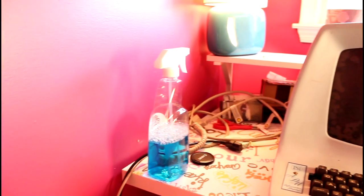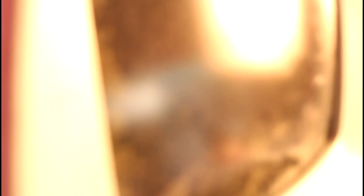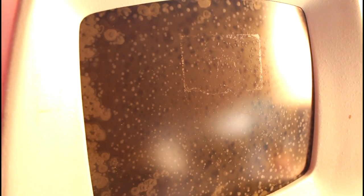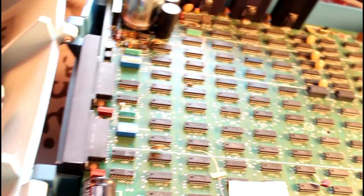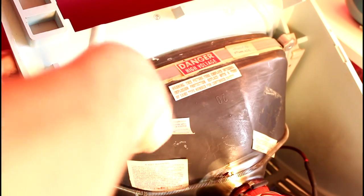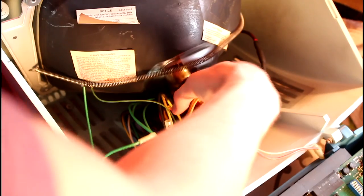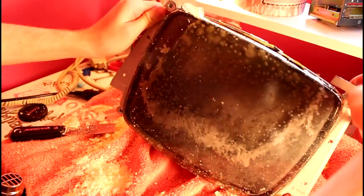But while I'm on the subject, here I have this ADM serial terminal from the 1970s. As you can see, it has horrible CRT cataracts, so I thought why not fix it while I'm on the topic? Opening it up, you can see that the main board is pretty much completely made out of discrete logic. I'm going to be doing the same thing I did in the last repair, just with a few slight modifications. This time I won't be using a heat lamp — I didn't really find it to be all that effective last time. And I'll also be starting with the CRT on its side, as the process seemed to go by a lot quicker that way.